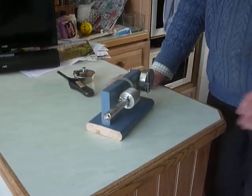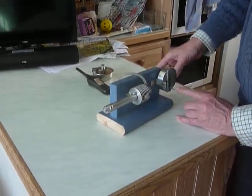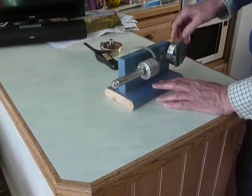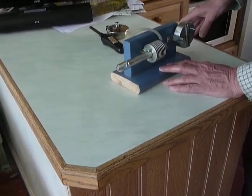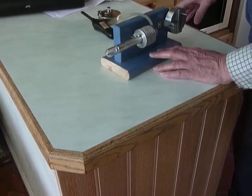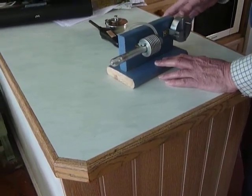This is a cold engine, and if you watch that piece there it's bouncing because this mechanism is moving the piston and causing a little bit of compression. That bounce is a good sign because it means there is compression, it's not leaking, and the friction is low. One of the sayings is: no bounce, no go.